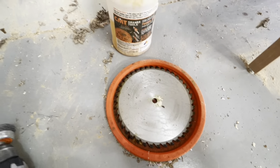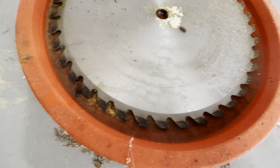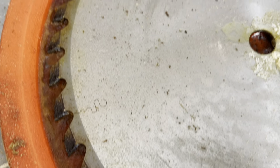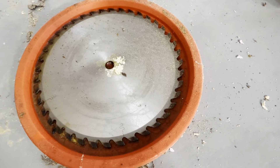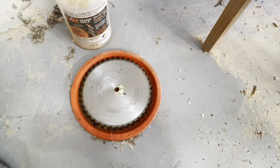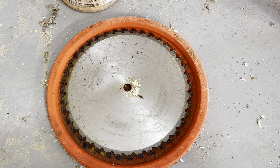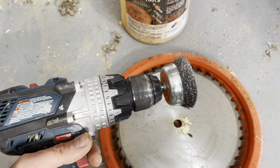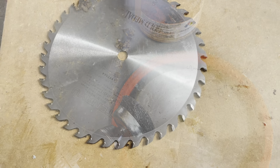Before I get into ripping these boards I want to put a freshly cleaned saw blade in. This has been soaking in CMT Orange Formula 2050 for a few days, which helps loosen up any stuck-on pitch, sap, or glue — in this case a little bit of everything including some Trex glue. This is a finishing blade from Tenryu, and taking this extra step to clean the blade is not only going to prevent burning, it's going to give me a glass-smooth finish, saving time and material. I'll use my drill with a rotary brush to clean it up, then swap it onto the table.